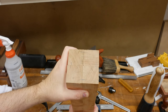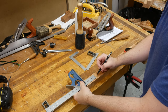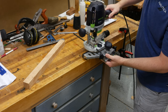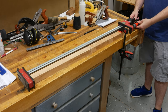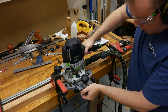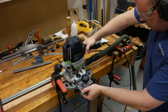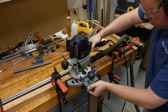When it comes to joinery, I always cut the mortises first and then fit the tenons to the mortises. I start by drawing reference lines for the stop, start, and center lines to line up my router with. I make this process as easy as possible by using three squares, and then to line up the router, I go off the center line of the router base. To keep the base from tipping, I clamp a leg end-for-end, which helps keep this operation safe. Using a quarter-inch upcut spiral bit, I plunge the full depth at the start and end of the mortise. This makes it easier to hear when you reach the end of the mortise when routing away the waste in the center. After this mortise is done, I flip the leg over and rout the other mortise, since each leg will need two mortises.